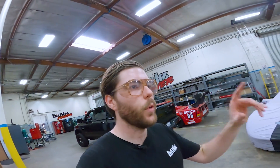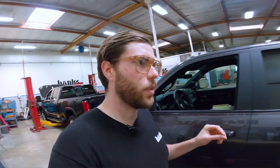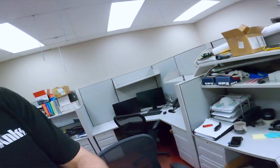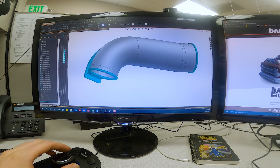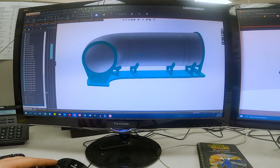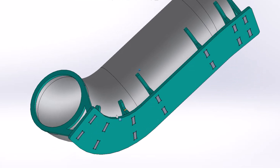The new printed intake is on its way to Sean right now. All he needs to finish the hood cut is our intake tubes. These intake tubes are a little funky now that we've changed some dimensions. To help, I'm going to whip up some CAD jigs — try to make these things as accurate as I can. I just finished a fitment jig; Matt shot me over the isolated CAD of just the tube. They're going to end up being mirrored parts, but they can share the same jig. What I put together in teal is a basic tabbed and slotted steel fixture.